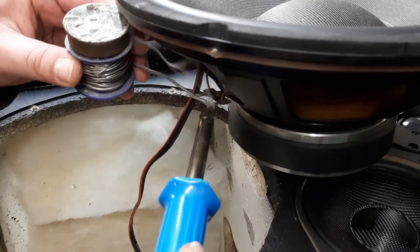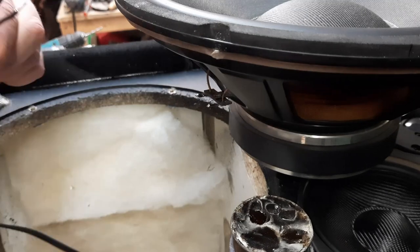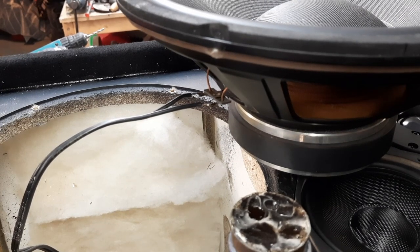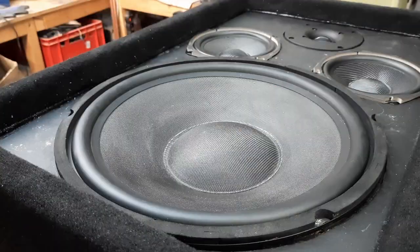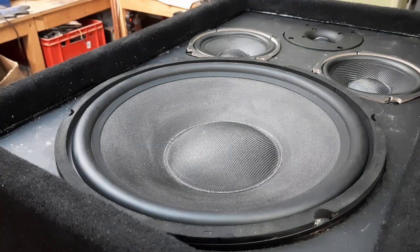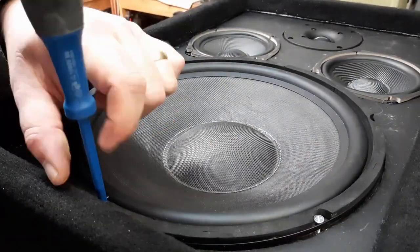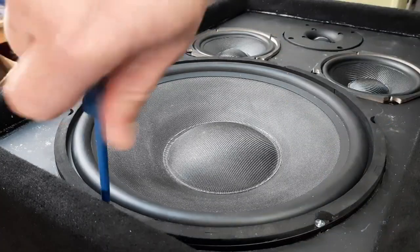This is the speaker with its membrane still not lacquered. This will come in later. And let's mount it up. I'm actually using nuts on the other side, because normal wood screws would not be strong enough, and also they would probably be good only for a few screw ins and screw outs. So I'm using a metric M4 bolt, something like this.